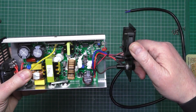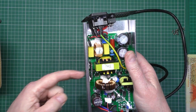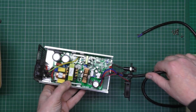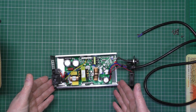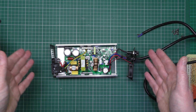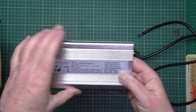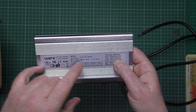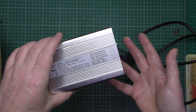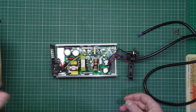What I'm going to do is put it all back together after I've loosened that screw off and straightened that bar. There's my new power supply. These are only 30 quid, believe it or not, which I'm really impressed with. I'm not going to be using any more than 2.5 amps — any more and you risk damaging the batteries. They'll actually take up to 5 amps, but it prolongs the life of the batteries, so I'm not going to.